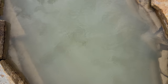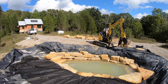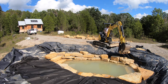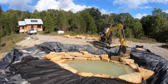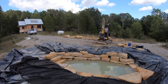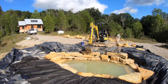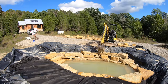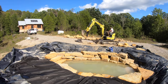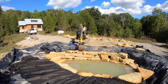Once again I arrived to find the pond partially filled with water. I decided to leave it in there because it was a good point of reference when stacking the rocks. What I'm doing here is known as rocking in — placing the rocks and backfilling with gravel. You have to do this to hold down your liner, or in my situation, a sediment isolation layer. My liner isn't really required for waterproofing because this pond is built in pure clay, but if you're building in a different soil type you need to be much more careful about puncturing the liner.